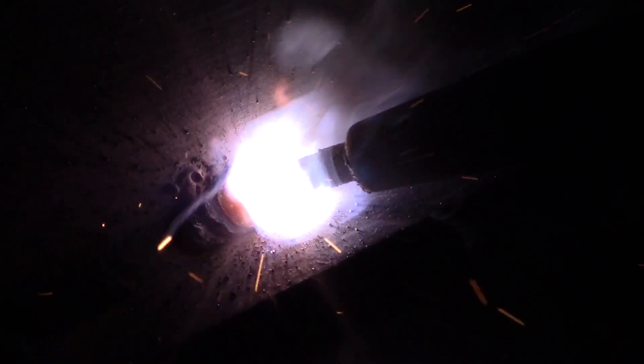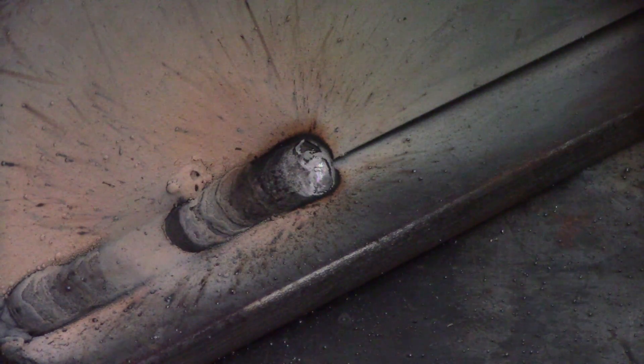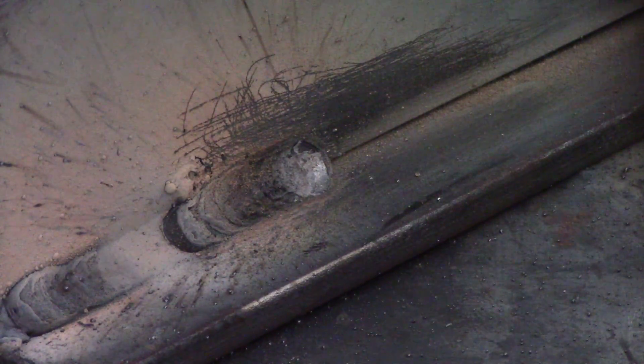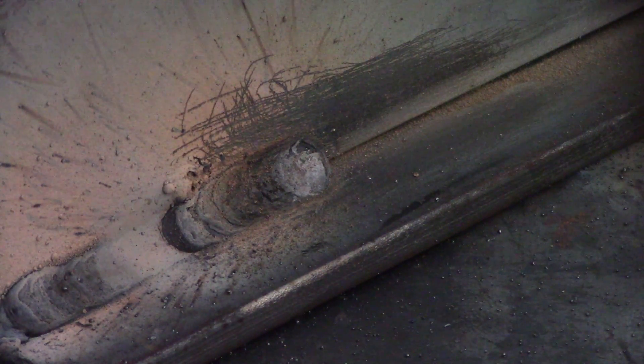Now I'm going to do a whip back-and-forth motion — just back and forth. You go ahead a little, lay a bit of weld down, come back and weld over it; it makes a pretty decent weld profile. With your stop-and-starts, make sure you always clean your slag off where you're going to start. You don't have to clean the whole weld, but at least where you're going to weld over again — that little fingernail-looking section on the end — make sure you clean that off.